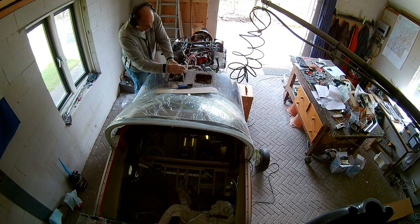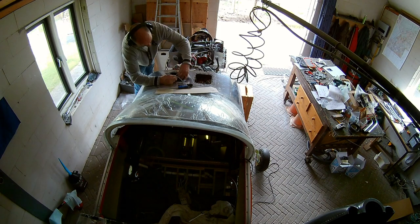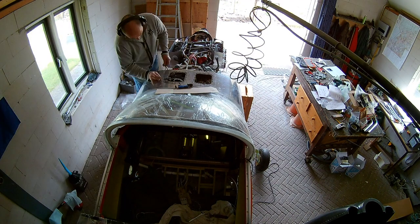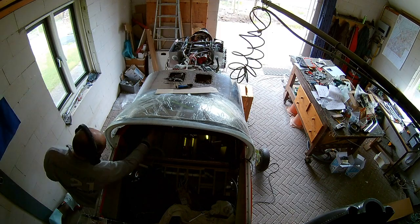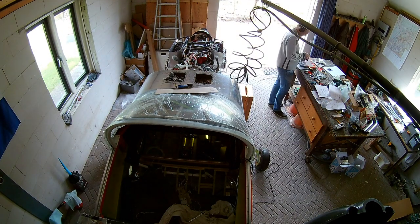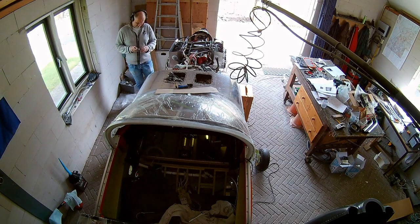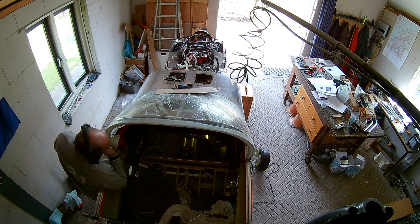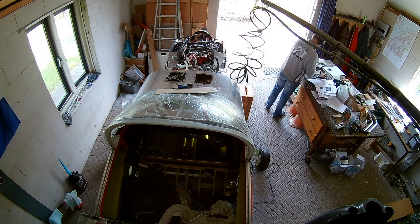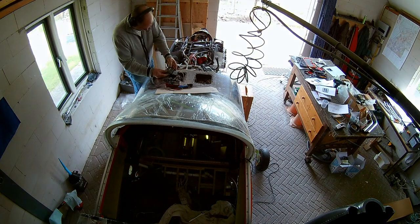Obviously, I built my own, which was maybe not so smart because it took me a considerable time to debug it. There was an error in the drawings, which resulted in a CAN bus high, CAN bus low reversal, which is a very common mistake. And I could measure that because of the way the CAN bus is set up, you can determine which one is high and which one is low. The name already reveals it a little bit, of course.